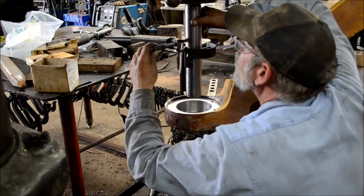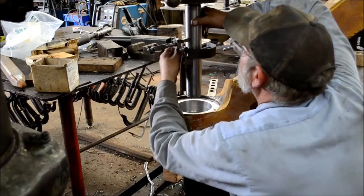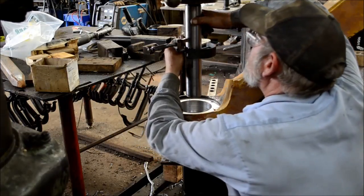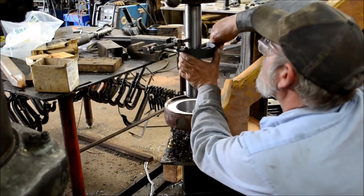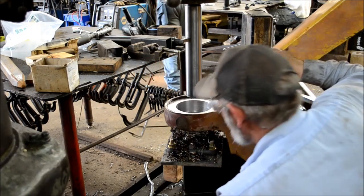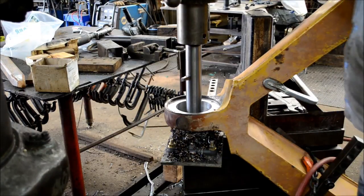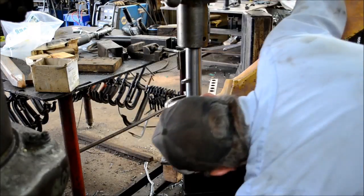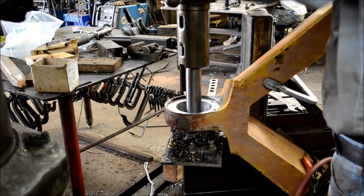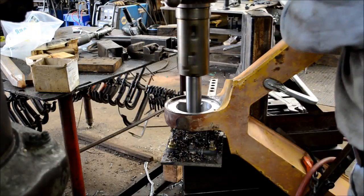Now I'm going to back it up to half the amount I want to increase the size of the bore. I'm using my right hand to push the tool up tight against the micrometer and then tighten the tool back down. Take this off and get ready to make another pass. Put a little oil in the end of my boring bar where it goes through the bearing to reduce wear and friction. And away we go, ready for another pass.